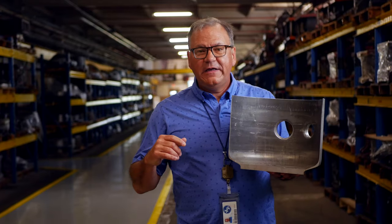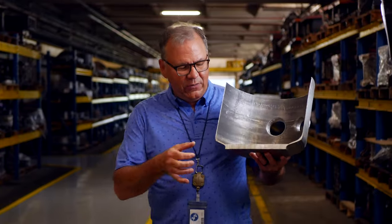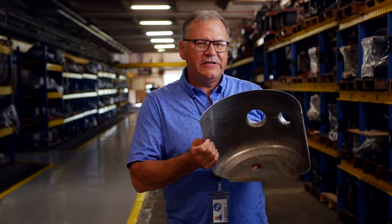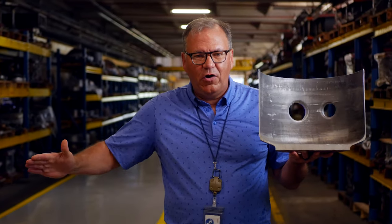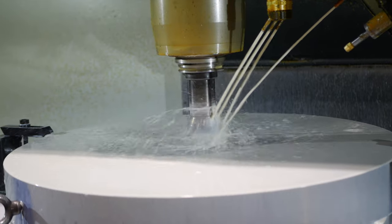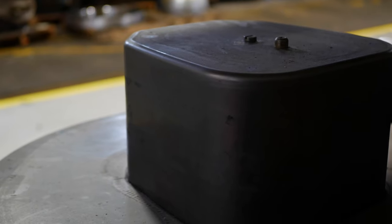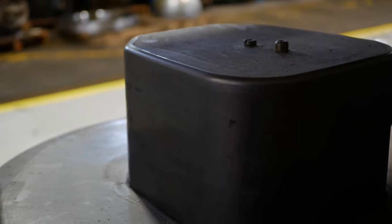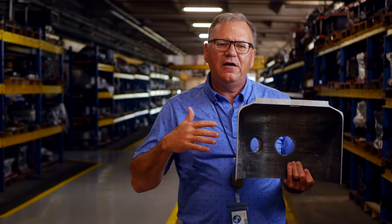We can form variable thickness of material. In this case, we actually machined this in the flat — we took a piece of stainless that was a full-thickness plate and machined it down so that we could form it up. If you look at the inside, the ID is the shape of the tool, but the OD, the outside, is the machined metal. Our press doesn't care if there's variable thickness — thicker in the corners, thinner on the sides. Stamping can't do that.